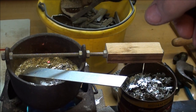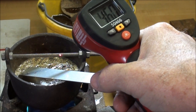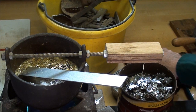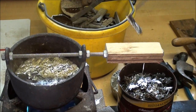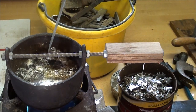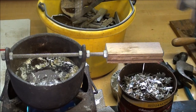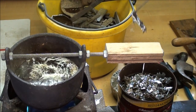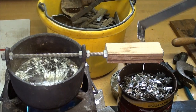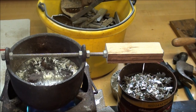I'm back in the garage. The lead is melted and I'm getting about right around 500 degrees — a little less than 500 degrees. I'm gonna scrape the dross off. That's just impurities that float to the top, some of it due to the atmosphere and air reacting with it. I like to get that off. I just throw it away, but big firms are able to sell their dross — like a steel mill that galvanizes, there's a tremendous amount of that zinc. It goes back to the refineries, gets re-purified and re-sold. Waste not, want not.